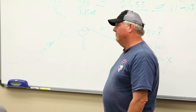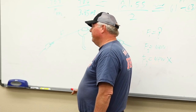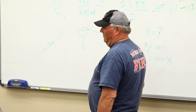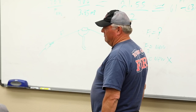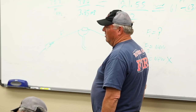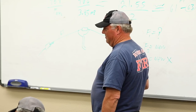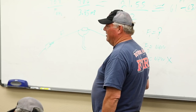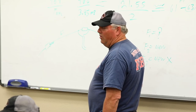Yes. So, dumb question, but when you have the wire, you've got 63 feet there, and you're going to say, okay, I'm going to make it 62, and I'm going to run it through my insulator. I'm going to wrap the wire around itself. But there's still 63 feet of wire in there. But it's wrapped around itself. So since you wrapped it around, it's not going to see it like that. Correct. Even if it's insulated. Yeah, it becomes one conductor.